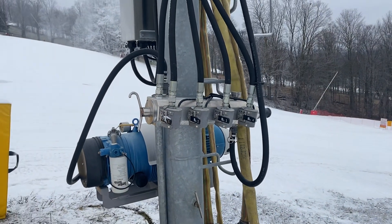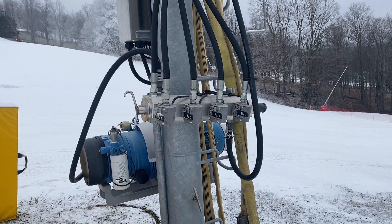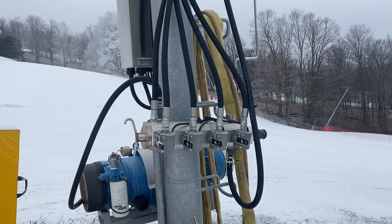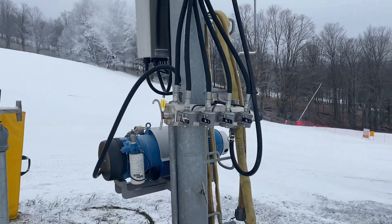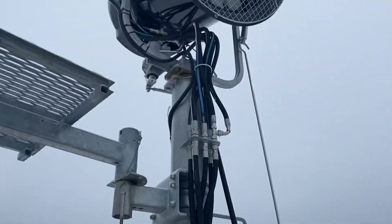What you're doing here is actually just adding additional water to the gun. On your colder temperatures it's going to allow the water to freeze — you're going to have more production and therefore make more snow. If you try to open them up on a milder day, you're just going to get a lot of wet snow. That's basically the principle behind these guys.